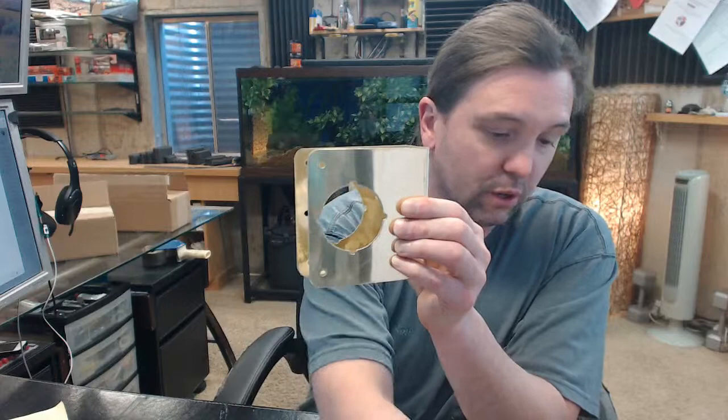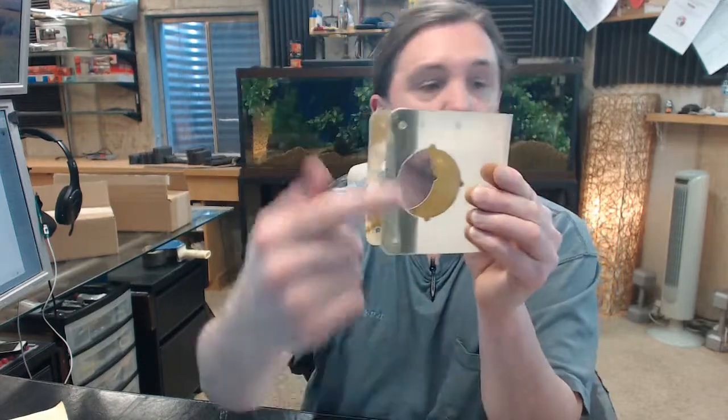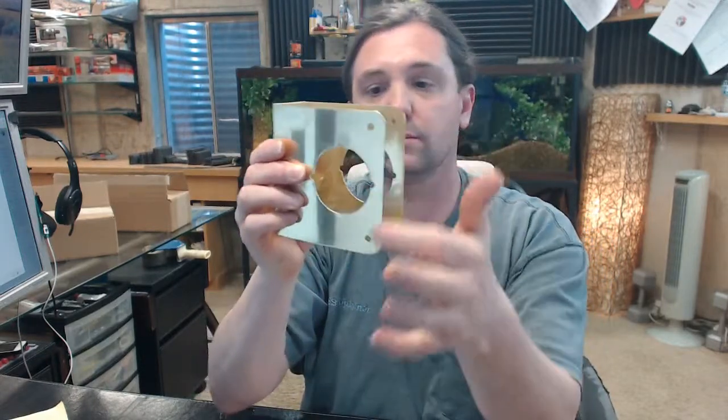You're going to attach that right to the edge of this because it's likely that the edge of the door is significantly damaged, where there's nowhere to actually attach that latch bolt to the door at all. If you had a VF style and the integrity of the edge of the door was such that it wasn't a problem, you might opt to use that, where this just fits over the edge and the latch bolt projects out of the hole. But if you've got significant damage, you'll attach your latch bolt right to the edge of this and screw it that way. Then the entire unit goes on. The other screws that are included are for attaching here and here.